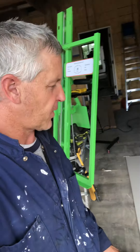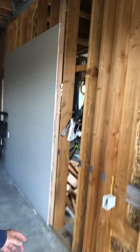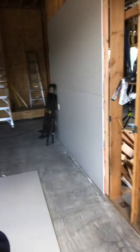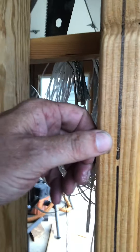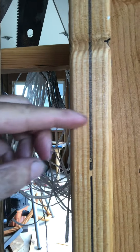Welcome to real estate investment management brokerage development. We're hanging sheetrock and getting two seams on the stud to fit together. This piece of sheetrock needs to stretch from here to here, and it's going to have to end halfway on this stud and halfway on this stud. The stud is one and three quarters inches.